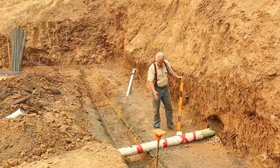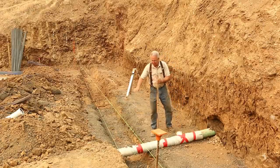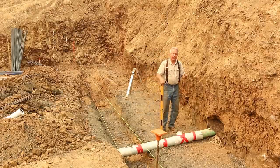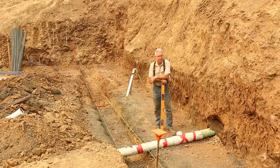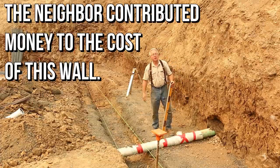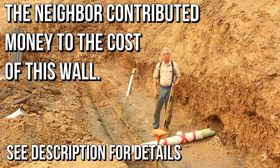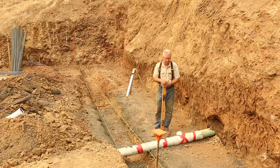If I brought the wall back and centered it on the footing, more has to lift for the thing to rotate. That's one of the things a structural engineer figures out. I specifically asked him to cantilever this footing so I wouldn't have a whole bunch of concrete sticking out onto the neighbor and degrading the use of his property. It's all going to be below grade, but it's still a cleaner, more elegant solution to a retaining wall like this.